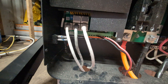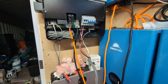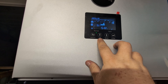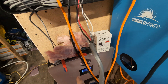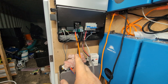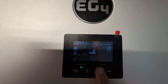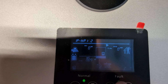I tried to get the two-wire start generator thing working and I haven't figured it out yet, but basically there are settings on here you need to set. It's set to phase one. I'm not sure if it's different for more than two units. One thing to be aware of is whichever one powers up first will be set as the host. We can check by going down three — this one says 'one PH,' which means this one is the host.